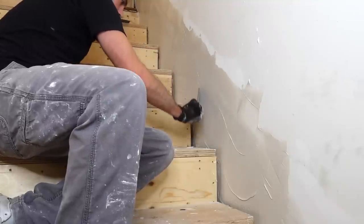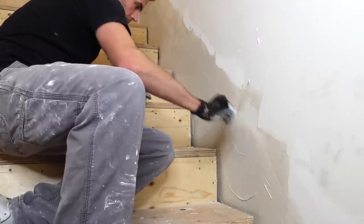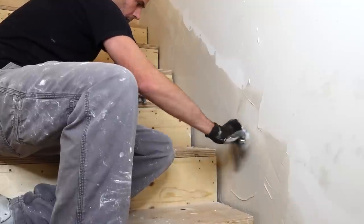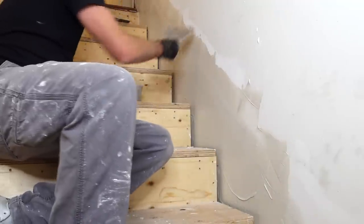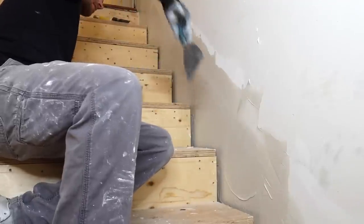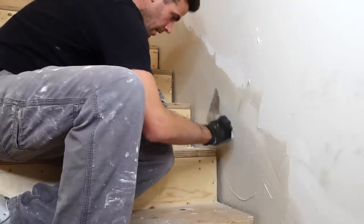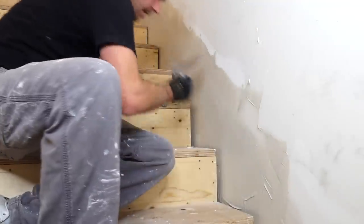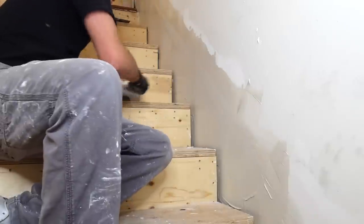Now that I have the tape looking good and fully embedded, I'm going to take a little bit of time to work on these spots and try to flatten that out before my next coat. This repair is a lot of work — it wasn't an easy one — but it'll look good when we're done. Feather your edge as always, and we'll get this down under there. That is how to lay those tapes.